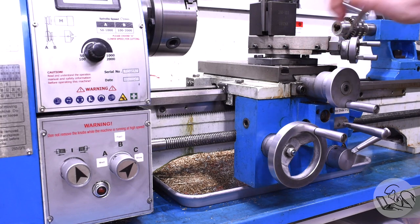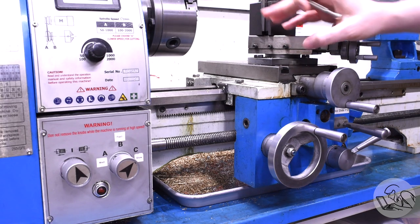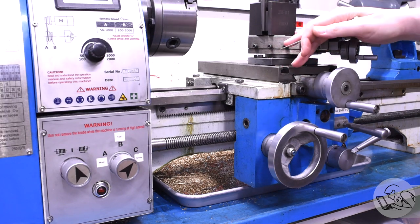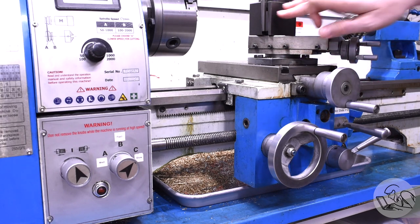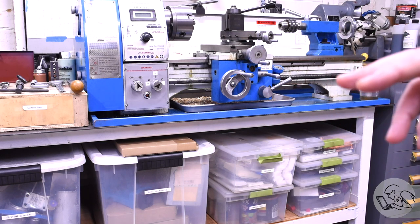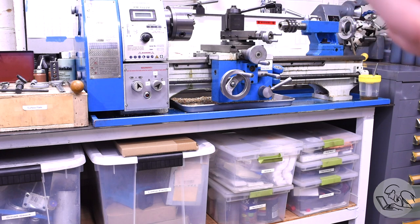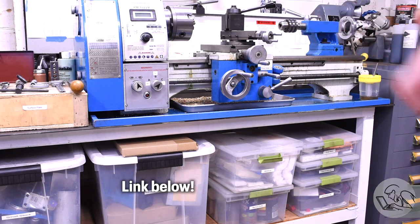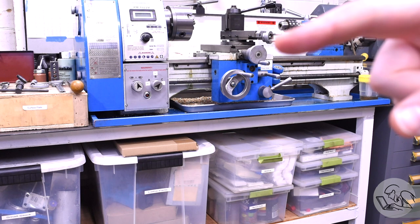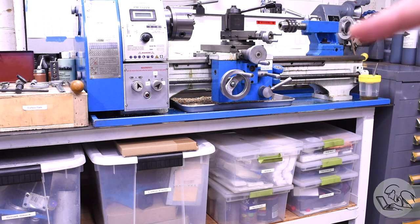If you really want bang for your buck, you've got to improve something in this loop. For example, eliminating the compound by machining a block the same height and sticking it in here is an easy way to dramatically increase the rigidity of the machine. You see people do a lot of things like bolting their small lathes onto concrete slabs, and yeah, maybe that helps a little. But if you want to improve rigidity, your time is much better spent focusing on this area. The value that the bench adds is to provide a stable base — something that isn't going to warp with humidity. After you've followed the instructions on my how-to-align-your-lathe video, you don't want to lose all that carefully aligned bed twist by having the bench warp underneath it, especially for hobby lathes which tend to only have one or two points where they're attached.